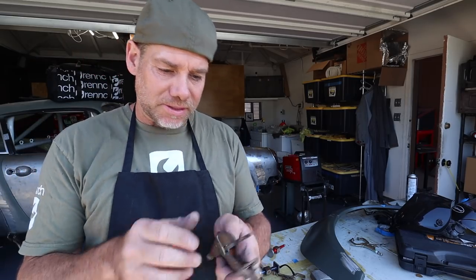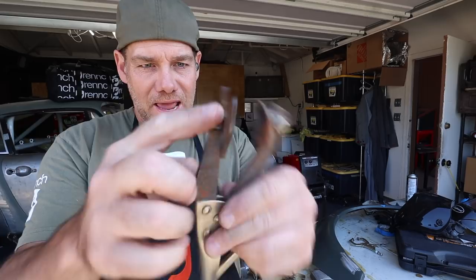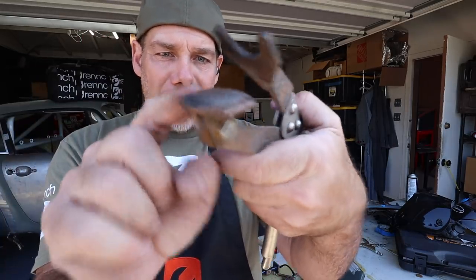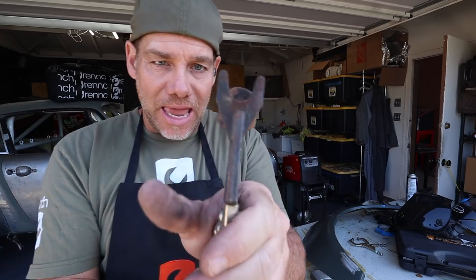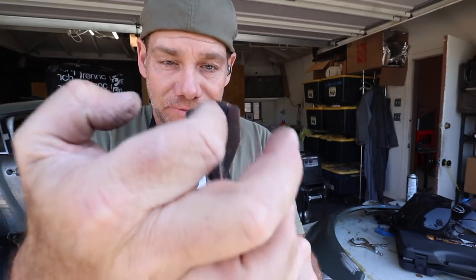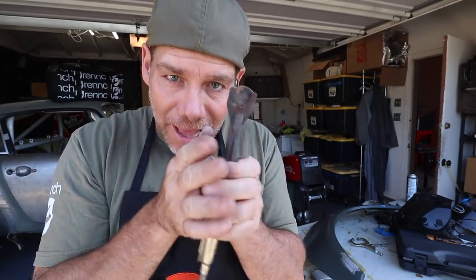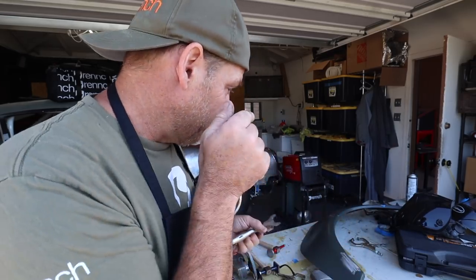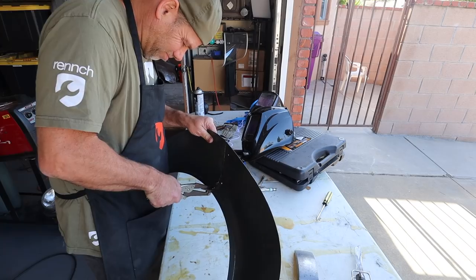So this gives me a chance to use a very special pair of pliers. These things are really interesting. They have a little U on the outside, and then the pad is actually a copper pad. So what you can do is clamp your two pieces of metal together between these two, and if there's a big gap, the copper will help dissipate the heat and it won't continue to blow the edges through. So this is like this perfect pair of pliers for this exact purpose.